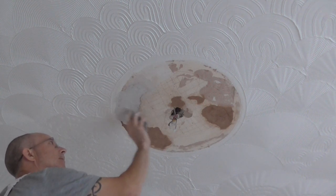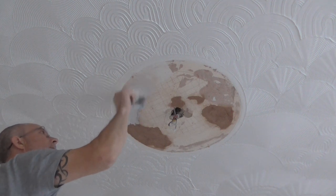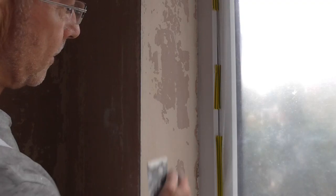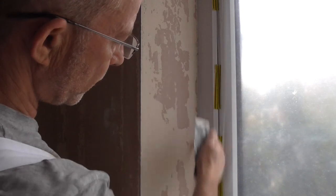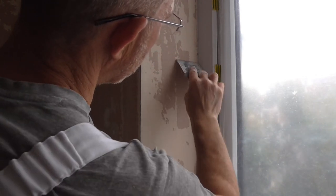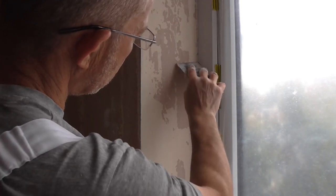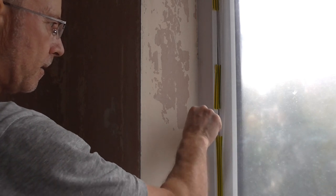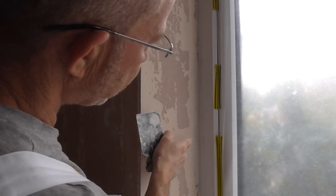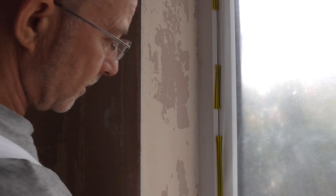And there's a little bit of filling round the window to do as well - I've already put some foam in, I'll cut that back. So again this just needs topping up with some polyfiller. You don't want to be getting loads onto the plastic and be careful not to scratch it. Once that's dry and you've done a light sand, you put some diluted PVA on - the rest of it just wipes off the plastic and leaves a very neat finish.